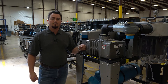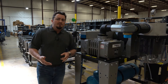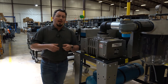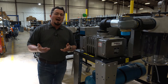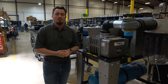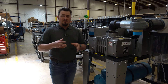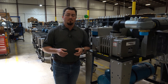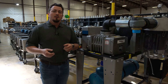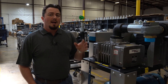There are other companies that offer what they call high vacuum pumps — how is this different? Those high vacuum pumps are primarily in the claw pump technology range. Claw pumps are designed for excessively high vacuum performance, which can be great in dense phase conveying situations. Claw pumps can be detuned to run in a dilute phase situation, operating at more reasonable vacuum levels beneficial for moving material in dilute or strand phase conveying. But the MVP series was designed to meet that high vacuum need at a much better price point.